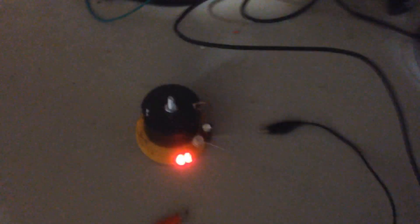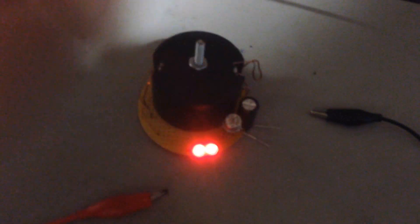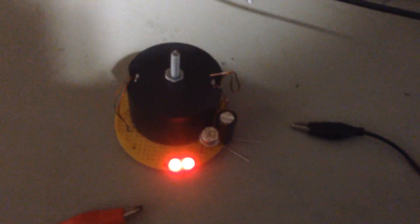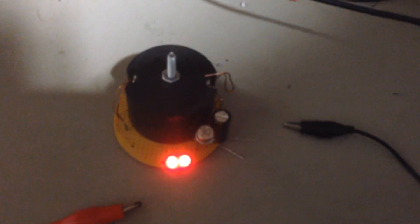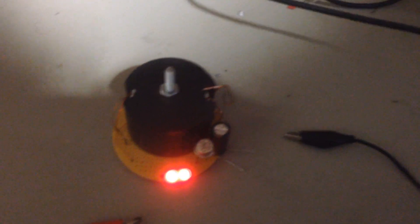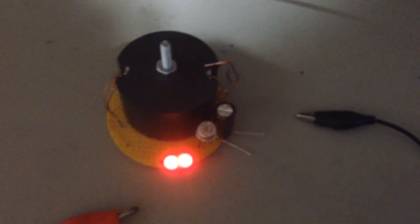Unless you want to watch 10 minutes of me doing the rundown — I haven't really done a lot of rundown testing to see how long this device runs. But based on what I've seen so far, it goes a really long time for a 3000 microfarad electrolytic capacitor. Earlier with a different transistor I did a test and it ran for over 10 minutes, and the voltage barely dropped. After 10 minutes I think it was down somewhere around 6 volts. So we're hovering right around the natural loss in voltage that these electrolytic capacitors have anyway, which makes it very hard and tricky to measure.